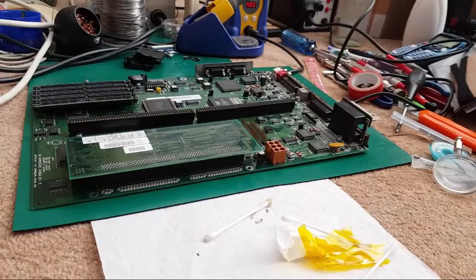It's this board because, like I say, you can be going up, down, up, down, up, down. It's not working. Up is not working. You spray it while you're moving up, down, suddenly it starts going up. It is definitely the shift register there, and I know that, because that is the only shift register that hasn't been swapped out.